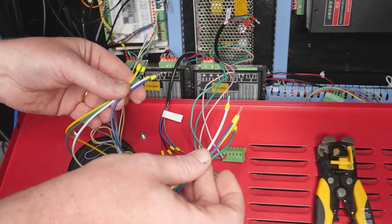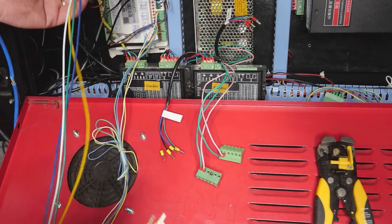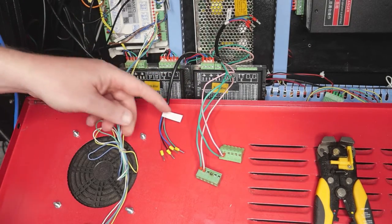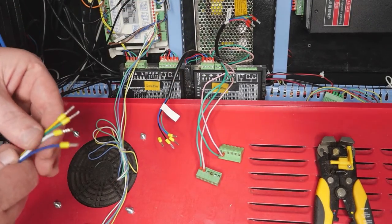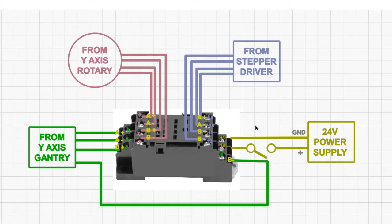I've made a new set of wires to plug into the terminal we took off, and these will run off to our relay. Try to keep wire colours consistent to help with fault finding — I didn't have the right colours available but as long as it's wired correctly it's fine. Rather than show you the wiring inside the machine, it's easier to show you the diagram included in the documentation — there's a link in the description. For orientation, there's a tab on the right-hand side of the diagram closest to terminals 13 and 14. The new wires from the stepper driver connect to terminals 9, 10, 11 and 12.